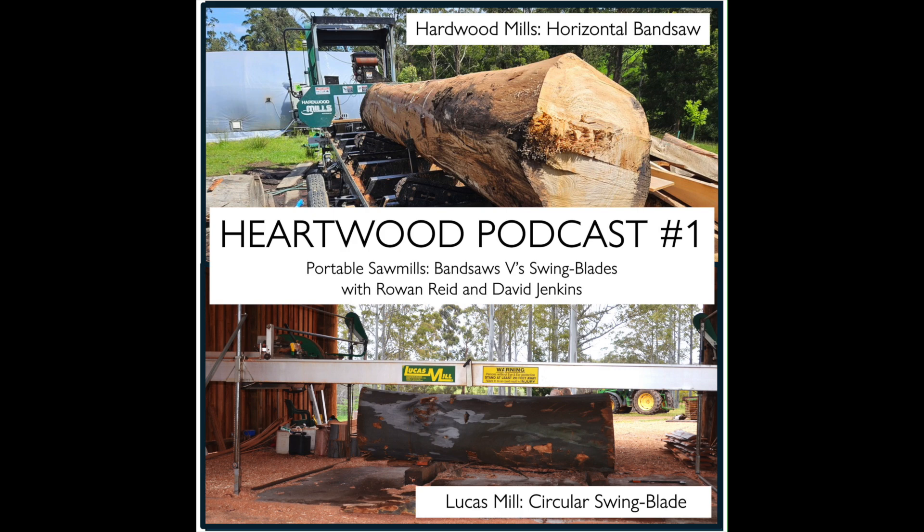The flooring David has been producing from the Sydney blue gum here is very attractive — lighter in colour than local Jarrah. It's hard, and the floor layers have been very happy with the process and the finished product looks magnificent. That's mostly back sawn. You do get that wavy cathedral grain in the back-sawn pieces, which people like. Most mills will produce a combination of both orientations once you get into a log. Rift sawn is halfway between back sawn and quarter sawn.